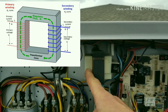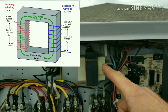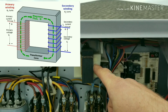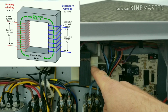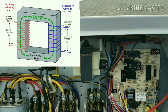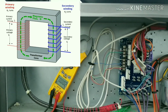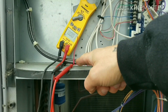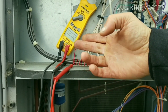As the primary side is energized, there's a magnetic field that rotates around the wiring and expands into the 10 turns of wiring on the secondary side. Once that magnetic field hits those 10 turns, it induces a small current — which would be 24 volts. I'm just throwing numbers out there to better explain this little experiment.